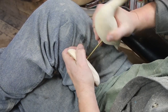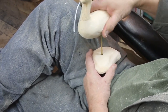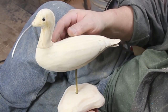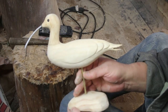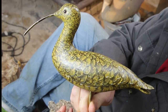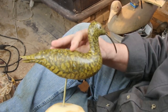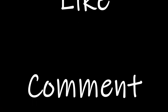I didn't spend a whole lot of time on how to put this together. It's a chunk of basswood — actually it's a chunk of pine on the bottom — and that is a brass rod I put in the middle. I could have used a wooden dowel but I didn't find one. I would prefer to use wood — no matter how well you glue the brass in, if you don't cross-pin it and set it down in glue the thing will eventually start to spin. So there's the end of the guy. You didn't have to paint him, you could have left it alone — I painted him and I wasn't totally pleased with it but I'm not totally unhappy either. And there's the difference between a smoothie and a decorative decoy. As always, like, comment, and subscribe — it's been Ben with Studio on the Lake.